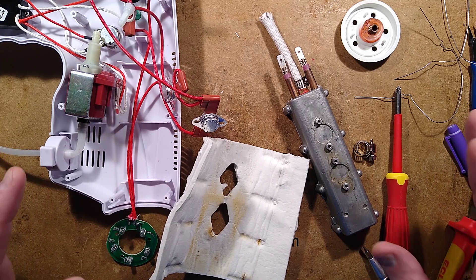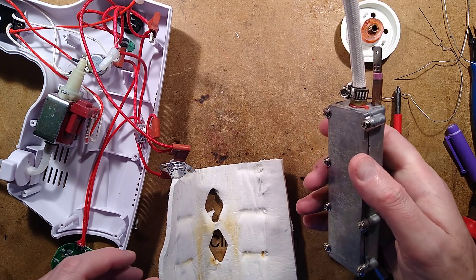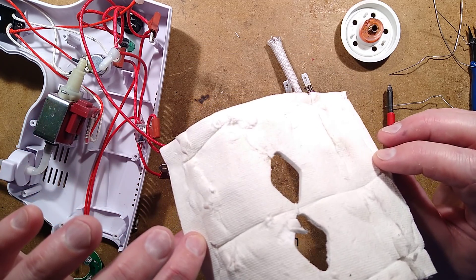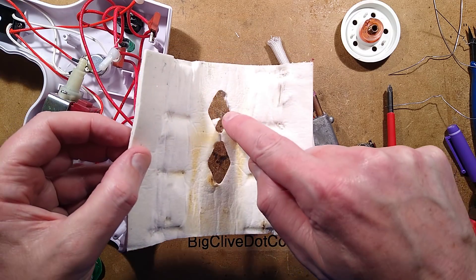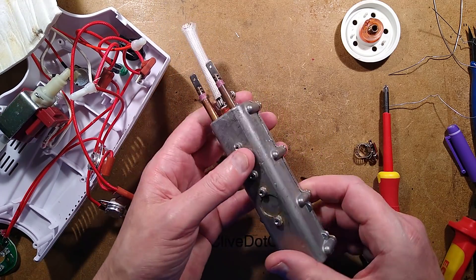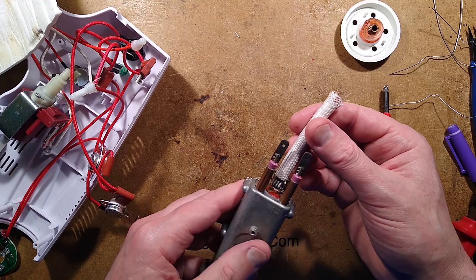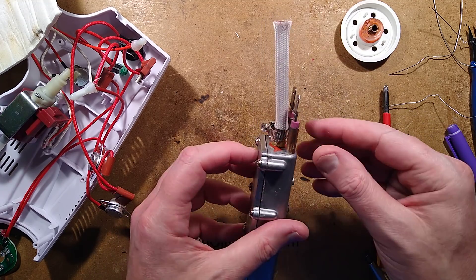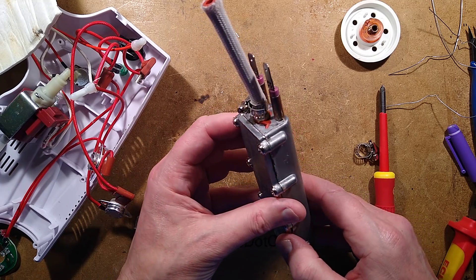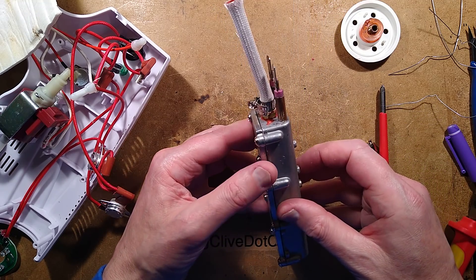Tea has been partaken of — it was soup, lentil and bacon soup. This has now cooled down to the point that I can pick it up and hold it. I've unwrapped it — it had this thermal insulation, and I think it is ceramic fibre. Nice that they've actually cut it out for the thermal switches. The unit has a fairly thick silicone rubber hose going in with fibreglass braiding over it, which is odd. It's got the heating element going in with spot-welded terminals, basically just potted right into the aluminium block.